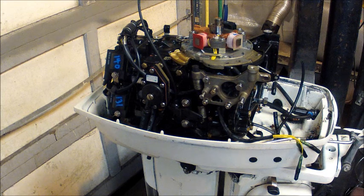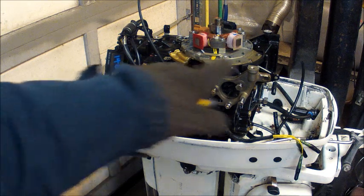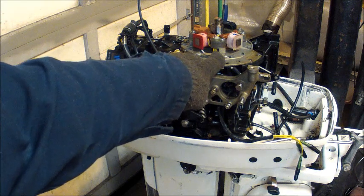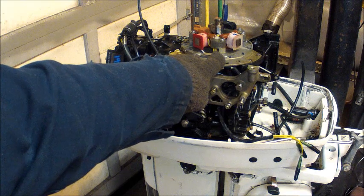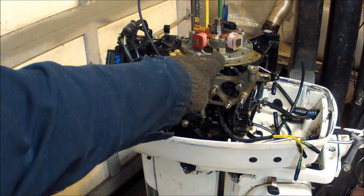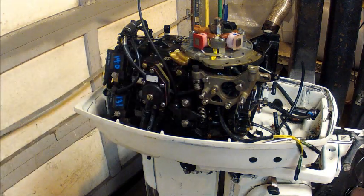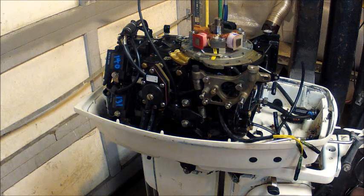And now what I'm thinking about doing is getting the carburetor all squared away, cleaned up, and then putting the carb back on, hooking things temporarily up, put that flywheel on here, the one off the 88, or 89, the one that has teeth for the starter. Go ahead and put that on here, torque it down, and start the motor manually with the recoil, and just see if that flywheel is going to run this thing. It fits and I get spark, but I just want to make sure before I go putting all this starter and wires and kill switches and rectifiers on that this thing is going to actually run with that flywheel. So I think that's the route I'm going to go. I'll think about it. I'll be back.